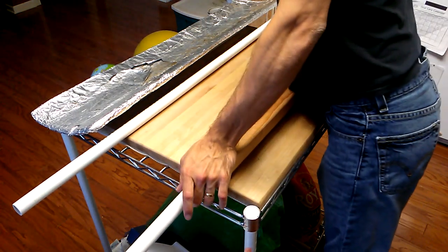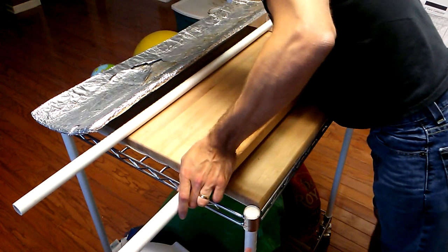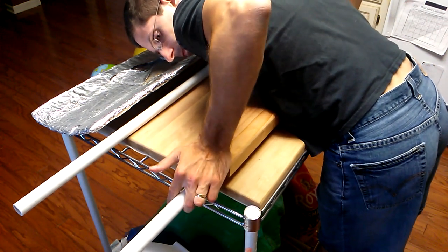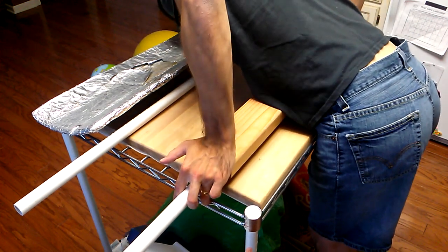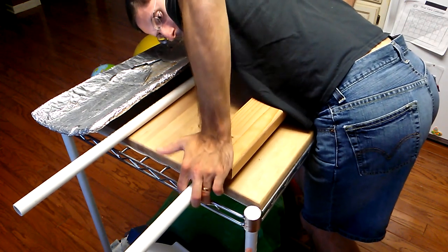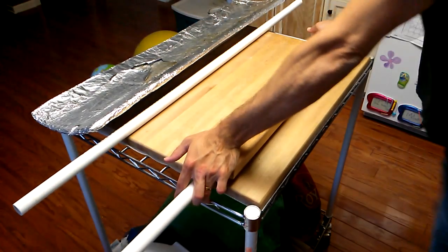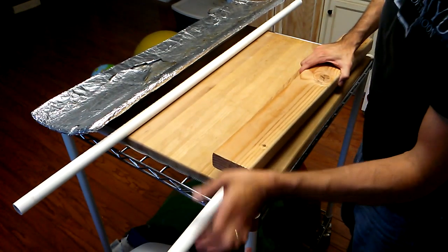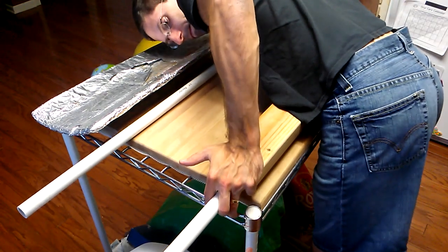In this case, I'm also going to use my hand on the end just to hold the end up so it doesn't sag. Otherwise, you can heat it and straighten it out later. Not that big of a deal. Yeah, looking pretty good. Now if you want, flip it over to the flattening jig, and that'll help to dissipate some heat and speed up the whole process.